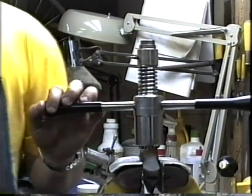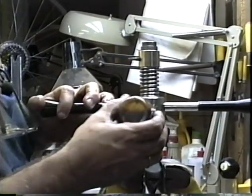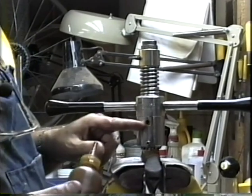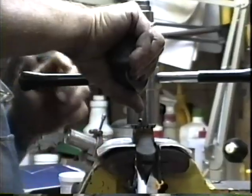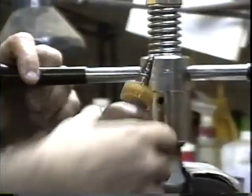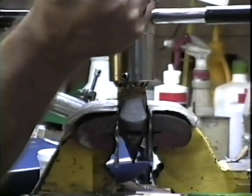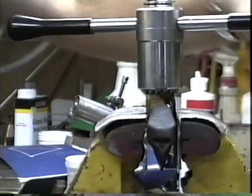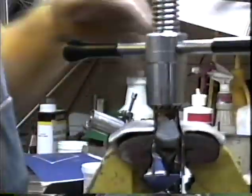Okay, now grab our cutting oil here. This is another tool you never turn backwards. I took this tool and I drilled an oil hole in the side so I can stick my cutting oil in through the side. It makes it a lot easier to keep this thing filled. Just squirt it in there until we see it squirting out the bottom. And this one takes a while. Cutting down from a 29.6 is quite a hefty cut.